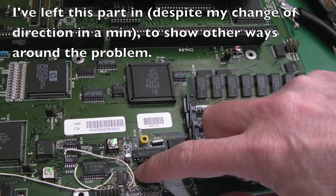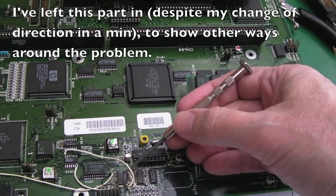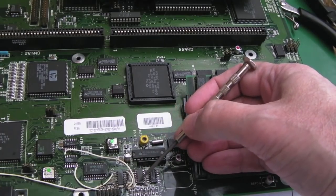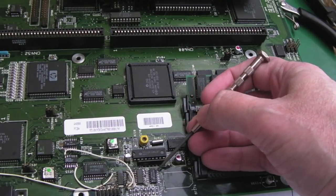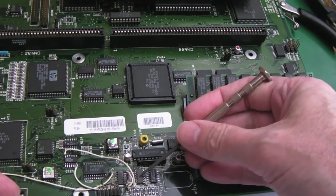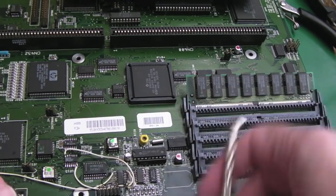I think before I commit to soldering anything around here, what I'll perhaps try and do is have a pretty sturdy 5 volt connection, the VCC connection. I'll use a pretty thick wire, like from a capacitor or something, to that pin there, and then the same with the ground to this chip over here, so that it'll act as a scaffold and just hold it, because it's a bit spongy, you can bounce it up and down and wiggle it around, and that's what you don't want.